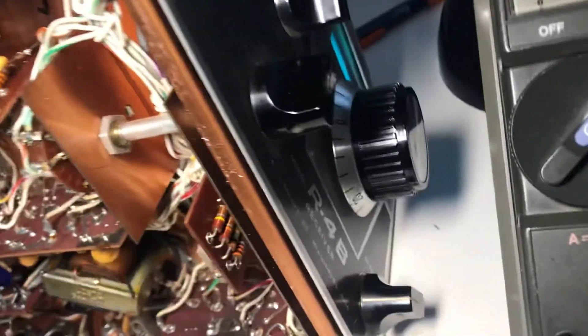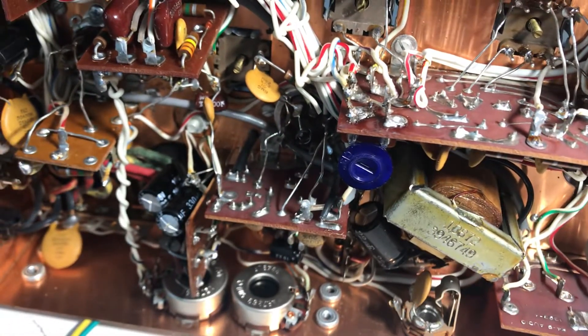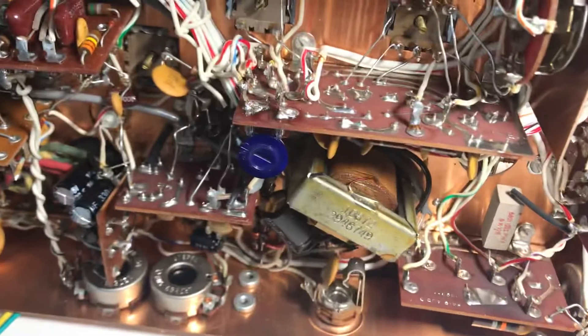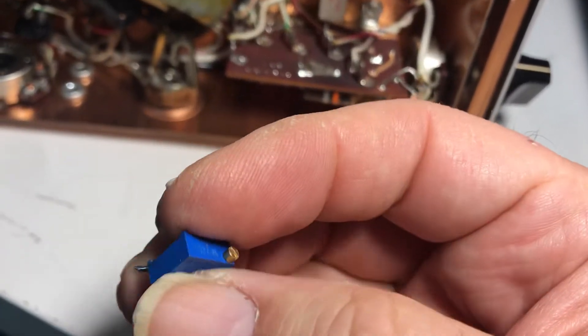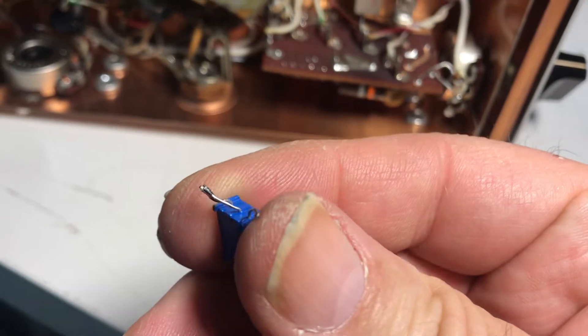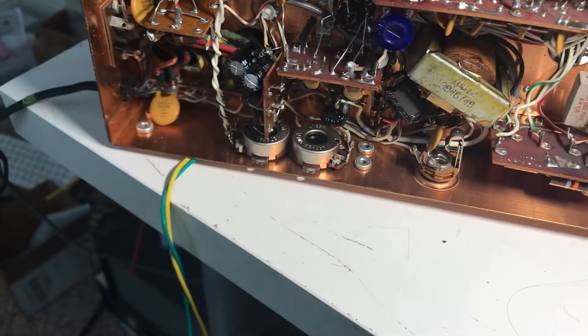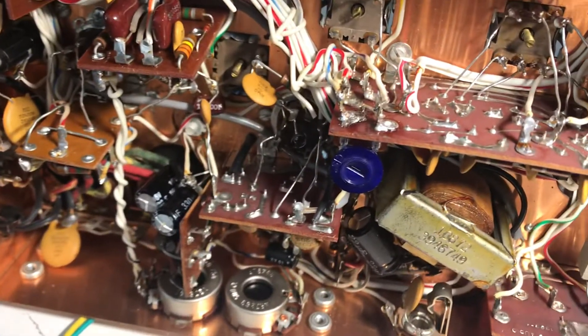Okay, hello again. I'm starting over on the S-meter calibration on this R4B. I just soldered in a new CTS potentiometer — I had bought some CTS pots off eBay, new old stock from probably the 60s. I had tried multi-turn 1k pots from China, but since my transistor was leaking or blown, I couldn't get it to calibrate. I bought CTS pots, but one seemed intermittent, so I replaced it. Now I'm going to restart the calibration.